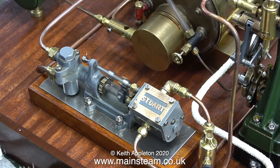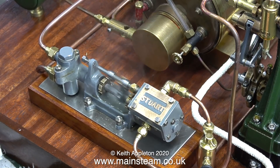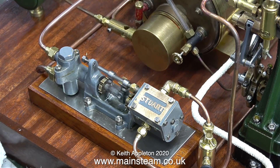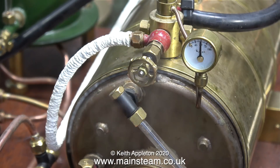Generally speaking, if they work at this speed, they're okay. And yes, this one works at warp speed as well. I have to say that these small Stuart pumps are really difficult and very fiddly to make run properly, but once they do, they tend to run like that for quite a long time. In the last high-speed run, I really turned up the steam pressure. I put some water in the tank, and once again it's actually pumping water into the boiler, so that's okay.